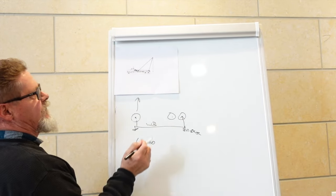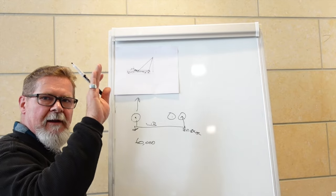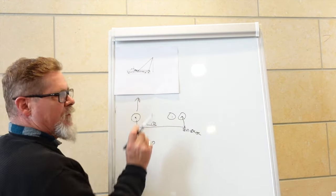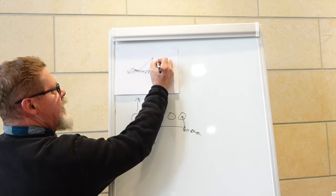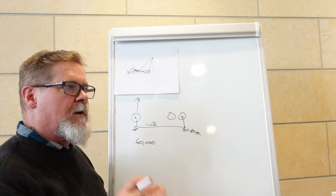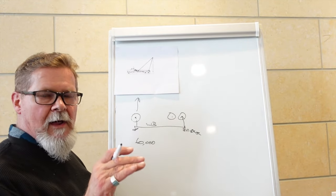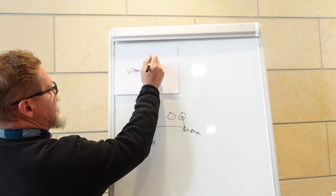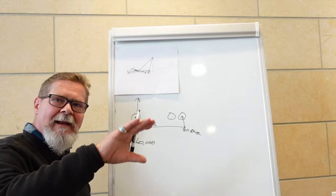So anyway, all the weight is up here. You've got some weight here, of course. And the more your poles are standing straight up and down, kind of like a crane, the higher your boom angle is and the closer you are to the load, the more the truck will pick. The more you lay the poles back, the more you lose picking capacity, but you gain a lot when it comes to mobility. You don't want to be running around with your poles up and down, because if they go the wrong way, they'll headache on you and you don't want to be inside there when that happens.